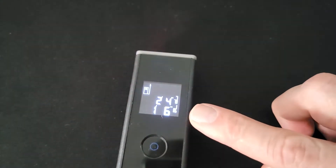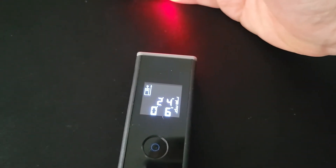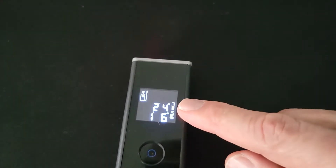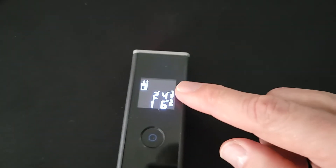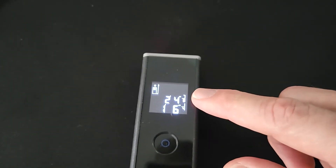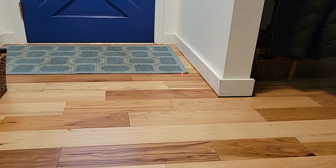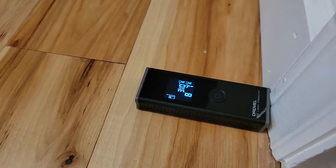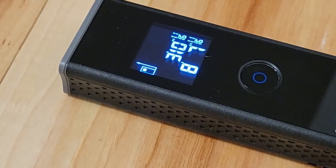When on, the display will give you two readings. The bottom reading is the current reading, whereas the top is the last saved reading. So if you had to get a length and width, this would be a nice way of just not having to write that information down. Simply put the tool up against the jamb, aim the beam where you want to measure from, and there's the calculated length of eight feet, seven and eleven sixteenths inches.